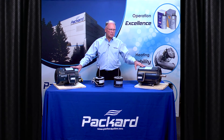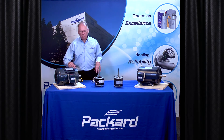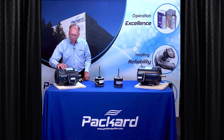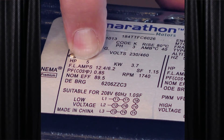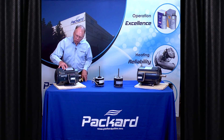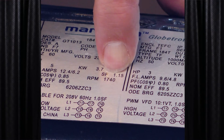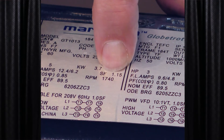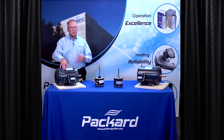It's different on general purpose motors. I'm not going to use the amps when looking for replacements on general purpose motors — I'm going to use the horsepower. So if we look on this motor, this is rated 5 horsepower. There's another consideration I have to take into account: not only the horsepower, but I have to look at something called service factor. Service factor is a multiplier. If I multiply the service factor times the horsepower, it gives me the actual total horsepower of load that that motor can operate.